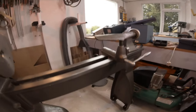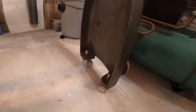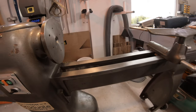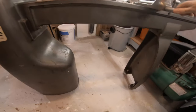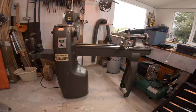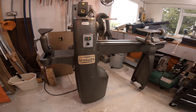You might notice something a bit special — this thing's on casters. Now this lathe weighs about 250 kilos and comes in two bits, but these casters are rated at 200 kilos each and there are five of them, so that's a tonne. As you can see, I can move it just with a finger — it's nicely balanced. On a reasonable workshop floor like this nice concrete, you'll be able to move it around wherever you like. One of the big problems with these lathes without casters is that once you put them in situ, they're there to stay. The casters are a great solution — you can pull the lathe out from the wall and clean all the chippings, which just makes a better job of it.